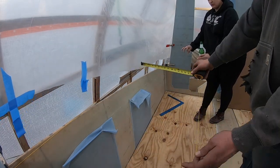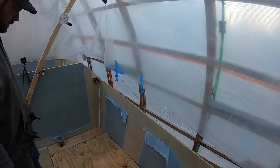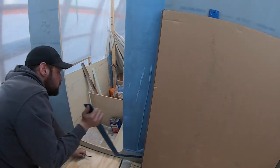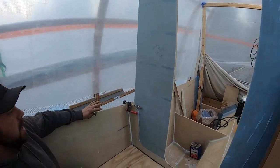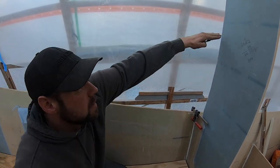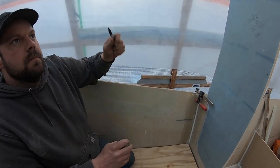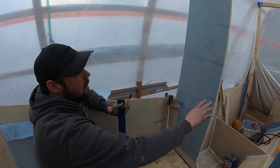We've put down a temporary floor and today we are going to be mocking up the starboard side of the cabin. I am marking out the height of the countertop on this wall right here - 36 inches, let's start with that. The gunnels are way lower than our countertops are going to be. The windows will follow this angle all the way up to the top, so we'll start our windows above the counter, probably six or eight inches, so this will just be a bare wall. We did push the bulkhead back two feet.